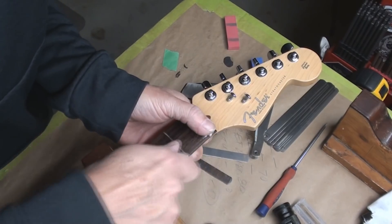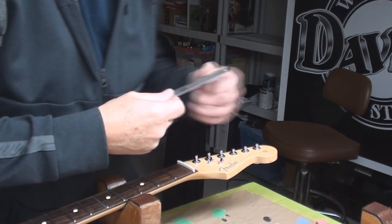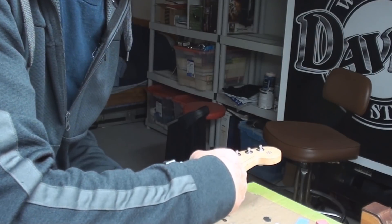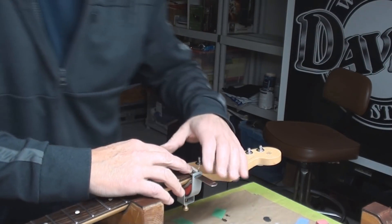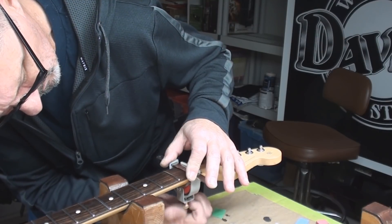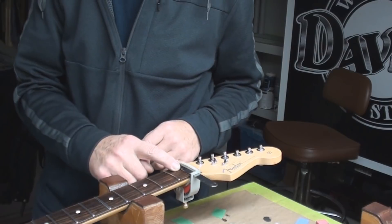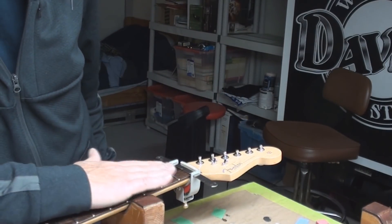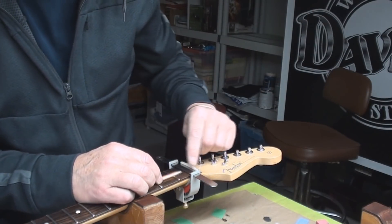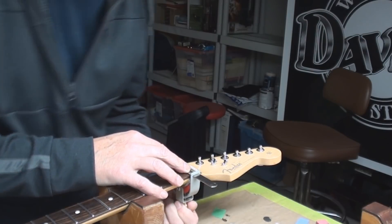I gotta get a better camera angle. Okay, I've got my string spacing. I'm going to use this fancy StewMac jig that I sort of bought under duress - only because it was one of those 'I have to buy more stuff to make the shipping worthwhile' situations. This is the fancy StewMac thing that lets you cut the slot to the right depth. When I use this and look at my half-pencil line that I made on top of the frets - I've showed you guys that before - the half pencil goes on top, we make a line that's usually about the depth of the slots. Well, would you look at that - that StewMac fancy thing is pretty much there.